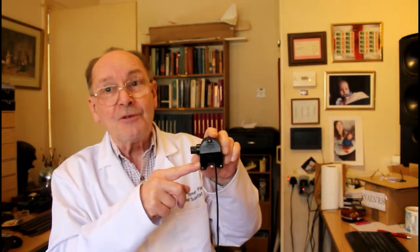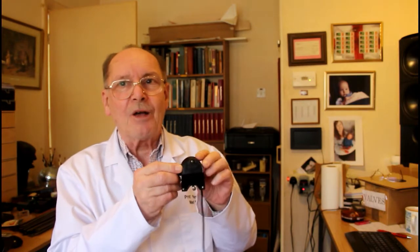The Igranic Phonovox was one of them, and we tried it out the other day because we thought it's important. And the coil, when we measured the coil inside, that was fine. That was 1,800 ohms DC resistance. That's great. And so we set it up and we couldn't get a peep out of it. So we thought, well, it's got to come apart.